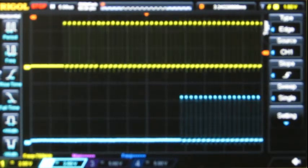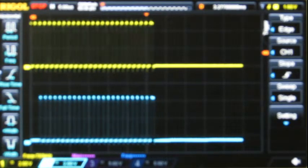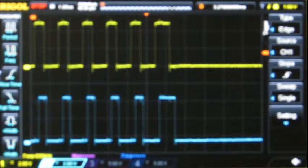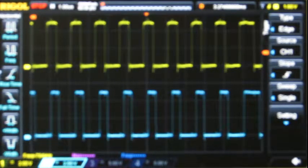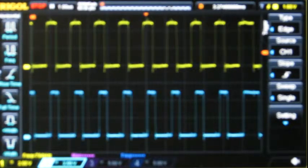Now if we go and look at blue on LED 2, which is the last byte, and we look at the last bit, we should see a 1. We should see the 1 bit here. Whoops. I got to quit moving my voltage reference. And here we can count backwards. 1, 2, 3, 4, 5, 6, 7, 8. There's the 8th bit starts. The blue starts there, and there's the bit 8, setting it to 1, and we have green and blue. And what that looks like under LEDs, I don't know if this will photograph. There's our green and blue.